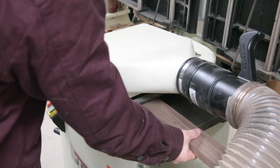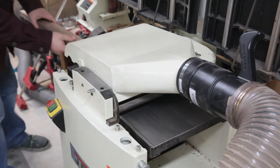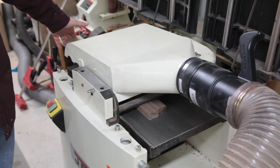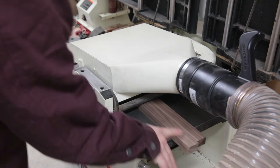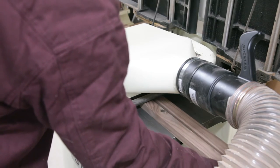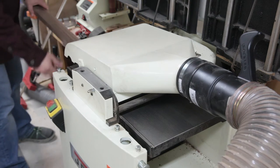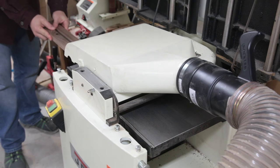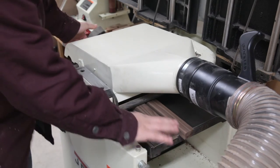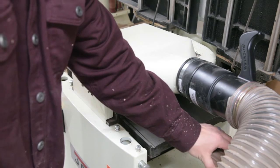It turns out this was more like five-quarters instead of four-quarters, so by the time I'm done milling here it's right at about an inch thick. There's a little planer snipe there, which at some point I'm probably going to address — I'll build some extension wings for this planer. It's made for compact shops so I understand why it is the way it is, but for my purposes I think I'm going to add at least another foot of in-feed and out-feed to this planer, so keep an eye out for that project.